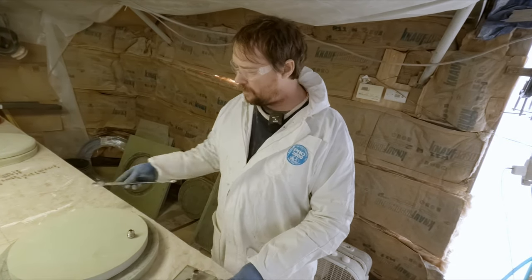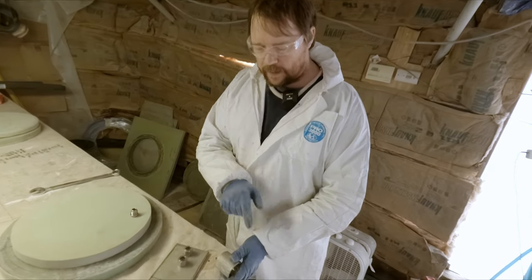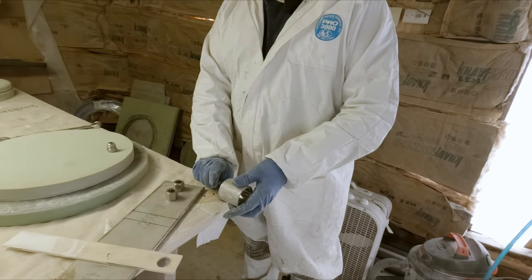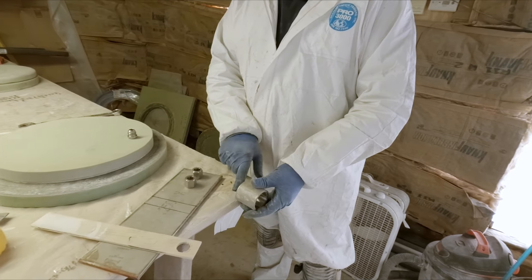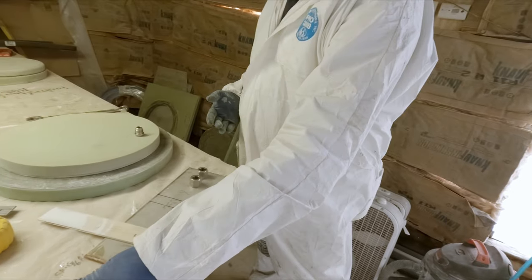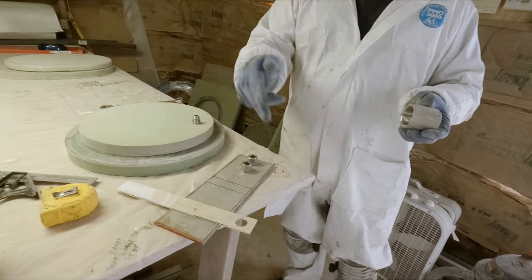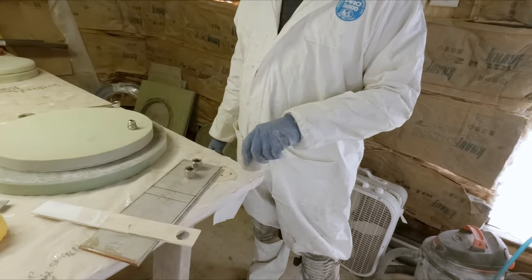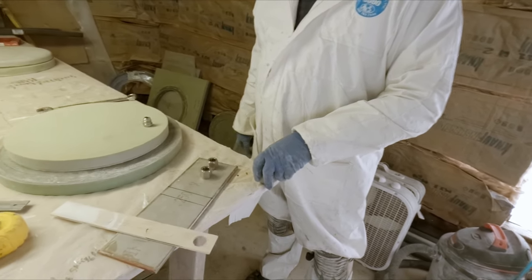We don't want it way up here. If this represents the floor in this back hold, we don't want it way up here, because then that means we're gonna have an inch of standing water there. So the drain is gonna be down lower so the water can run through it. The one for the other side for our water line, it can be raised up a bit so we're not getting any of this water running into that pipe. And that should make a pretty clean setup like that.